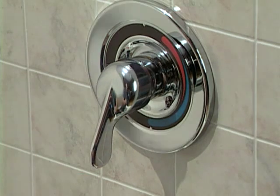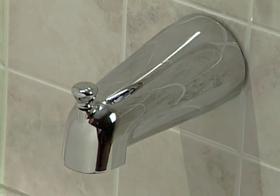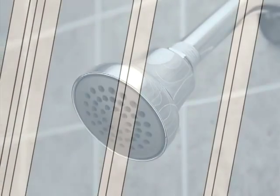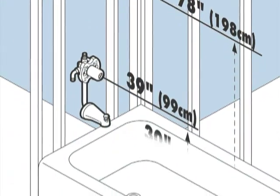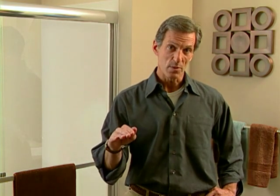We'll finish the job with our Cornerstone tub shower trim in chrome finish, so let's get started. If you're installing the plumbing at this time, the measurements you need are shown in the installation drawings that accompany each valve. You may also want to install a support brace for the valve — a 2x4 secured to the adjacent stud would serve the purpose. The top of the support should be 2 inches below the center of the valve.